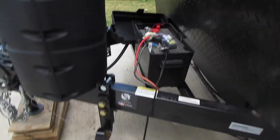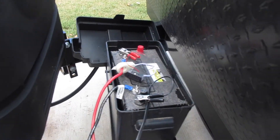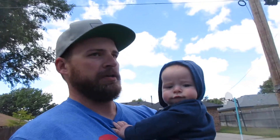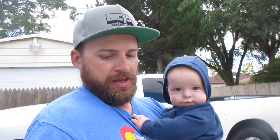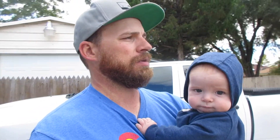All in all, I do think this controller and this little amperage reader is going to be pretty helpful. We're able to read the amps that the camper is using, and that's going to tell us a lot when we're out there boondocking. I'm pretty happy with this controller — it seems to be doing the job and it is doing much better than the other one. It's giving me the full 200 watts. A minute ago when the sun was shining we were going at about 16 volts, charging at almost 7 amps. That's pretty awesome.